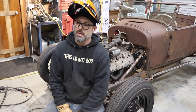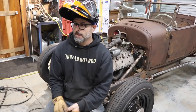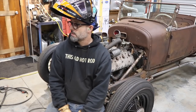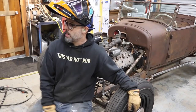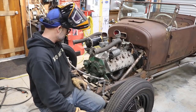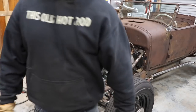I'm really trying to spend more time on finish welding using the TIG welder. I want to improve my skills and the only way to do that is by actually doing it. So let's go — I'll get my uprights cut, fit them on here first, make sure they're good, then tack them onto the mounts that are tacked to the table. Then I'll cut this off, get my measurements, get everything centered, tack it all together, and then finish weld it with the TIG. Check it off the list!